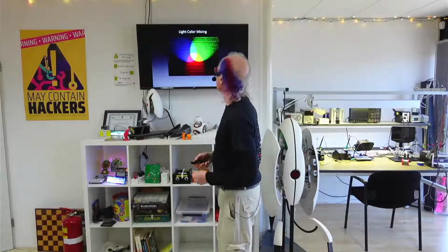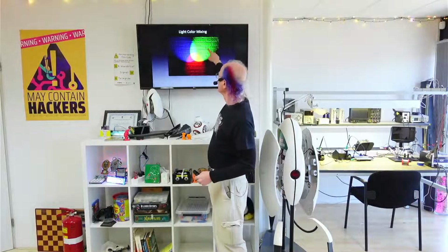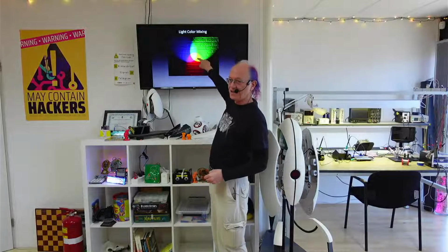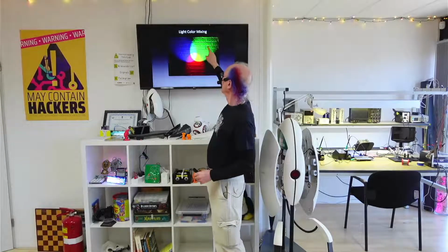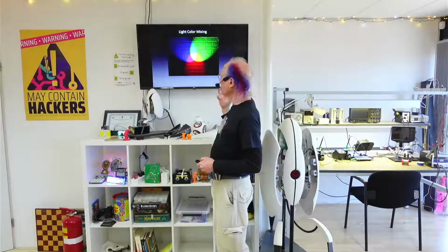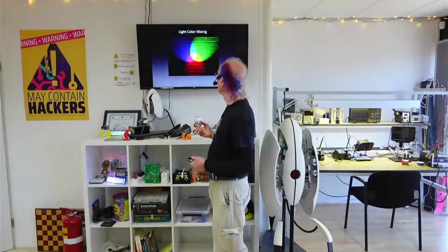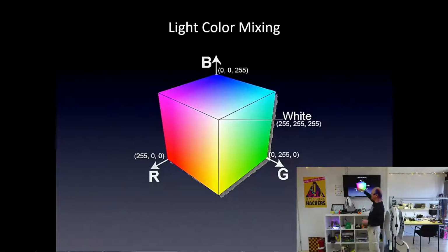real circuit. But if we take red, green, and blue light and mix them together, we get different colors. Green plus red light mixed together makes yellow. Blue and red makes magenta. And then green and blue make sort of aqua color. And you can get all sorts of colors, though, mixing red, green, and blue. And in color theory, they have this color space with red, green, and blue. It's this 3D space, and you can get any color, almost any color that we can perceive. And then you can add white light to it to get pastel-like colors and make it more saturated, taking the white away.